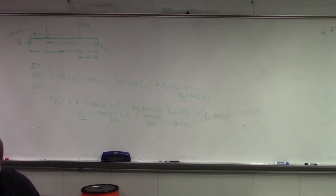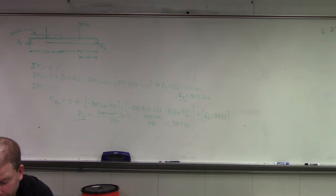So is it different for roof? Read them over. What page was that on, 161 or something? 168. Look at the page before that. Yeah, it is, so roof joists and floor joists are different. Oh, it's the same. You need 2x12.